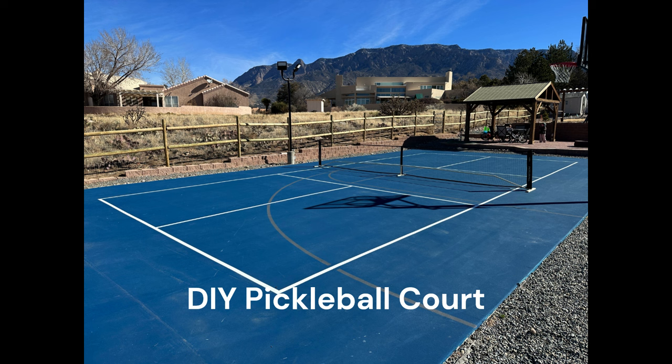I think the overall product turned out really good, but you'll see that the stress relief lines that I filled in do show up after a year or two of Albuquerque's winter-summer cycles. This is mainly because our slab was not intended to be a bonafide pickleball court — it's four inches thick, 3 KSI concrete with wire mesh embedded, so there's no rebar or anything like that. But regardless, maybe you can learn something from what I did or didn't do, so enjoy.